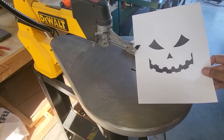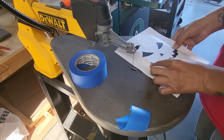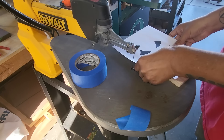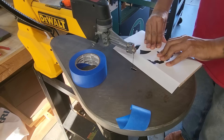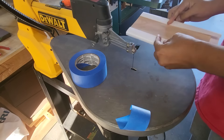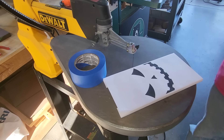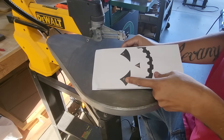For the faces, I spent a couple of dollars buying files for something like 100 jack-o'-lantern faces on Etsy. Several sellers offer these and they are generally very inexpensive. The ones I got came with PNG, PDF, SVG, and DXF files, so I can use them as images or on the CNC later. I just used the PNG files, printed them as 5x7 images, wrapped them around the boards, and secured them with painter's tape as a template. Then I took them to the drill press to make starter holes and cut them out on the scroll saw.